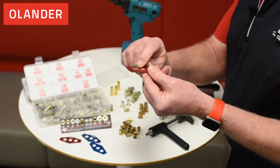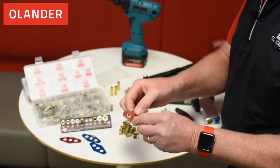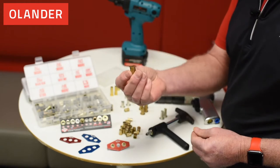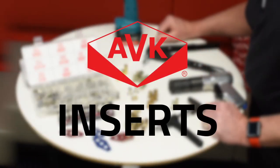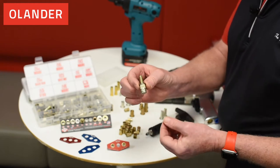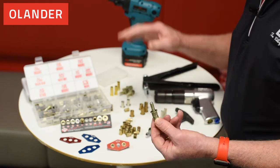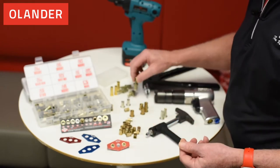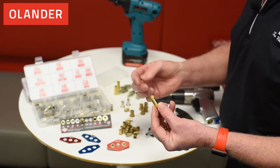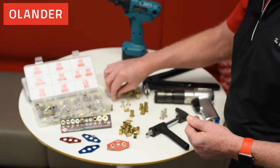After we collapse it, we have a flange on the back side. There's knurling on this insert to stop it from spinning as well. We also have inserts that have a hex punched hole for added anti-rotation, and AVK has their hexed inserts for that. This is an AVK stud — it's a regular AL series insert with a stud inside, crimped to keep it from rotating. These tools can also install these stud inserts. If you need a watertight solution, we also have blind inserts that are closed so they don't have a hole all the way through. These are installed with the same tooling. We also have the original rivet nut from AVK, the AR series, which is basically known as a plus nut and is used for plastic applications.